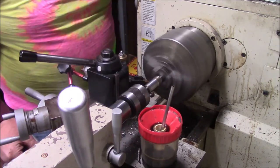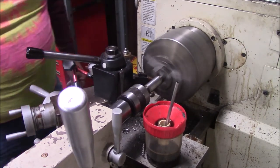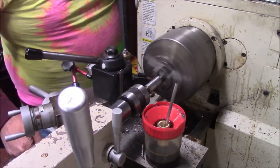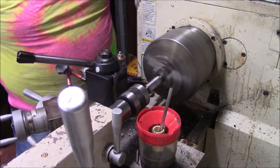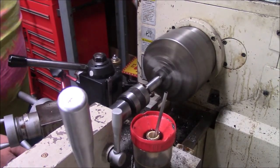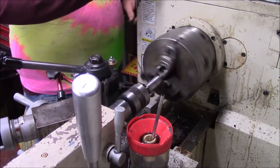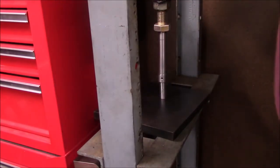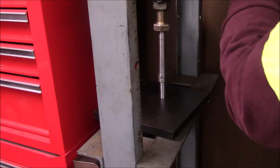I'm using a DNMG tool because I have to have that DNMG to get in between everything. I'm only taking about a 10 thousandth per side cut, and then I'm back-feeding just like boring, taking all the tool pressure off because I want this to fit exactly the way I want it to fit. When I get down there closer I want this to be about a thousandth oversized, and we're going to loctite and press it in. We've got everything figured out and we should be able to press this with no problem.